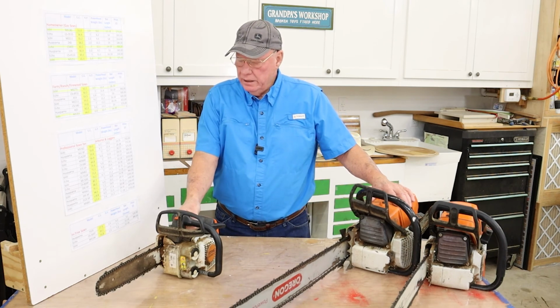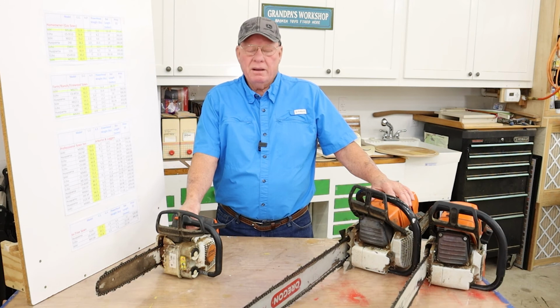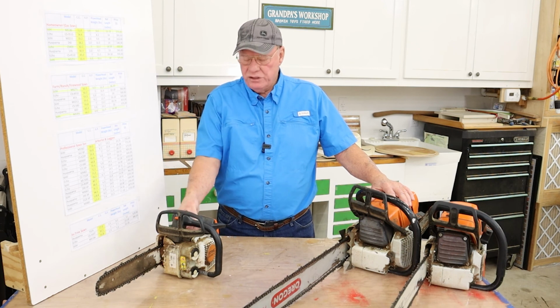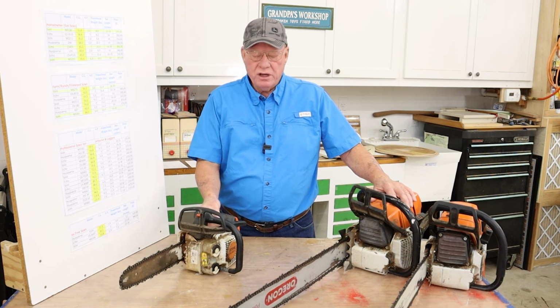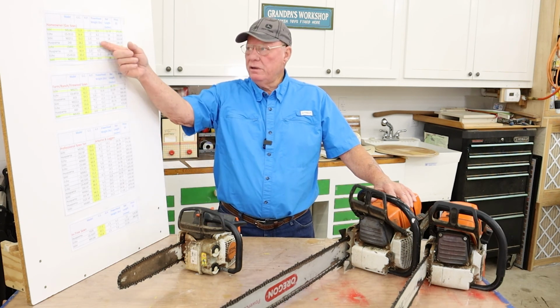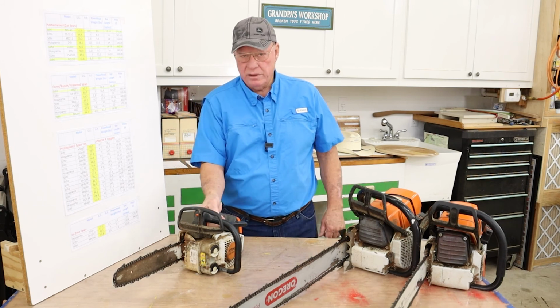Well below their body for the safety thing. And they usually got about a 12-inch bar on them because they're made to crawl up on top of a tree and cut limbs off. So it's a different kind of saw. You probably don't have need for one. Just be aware these in-tree saws are a different class of saw, but they're for very special purposes. So most likely you're going to need a homeowner style model which has 2 handholds on it rather than this single one.